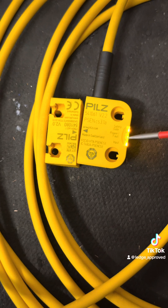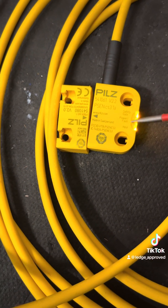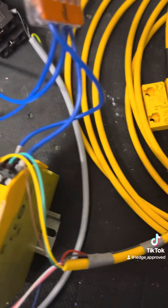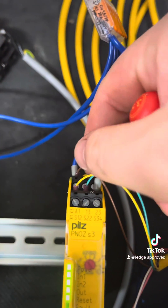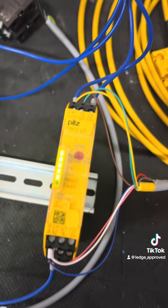So we've got a safety gate, so if this opens, once we lose this switch, that'll come off, and then if we have a fault or power fault, then we've got a power or fault LED showing us on the actual switch itself.